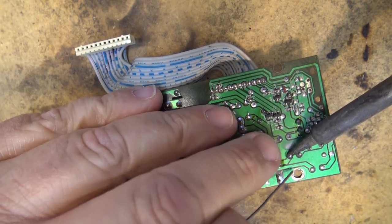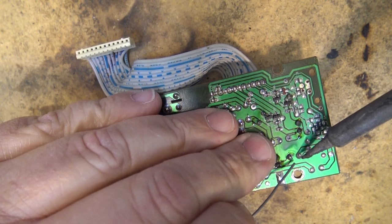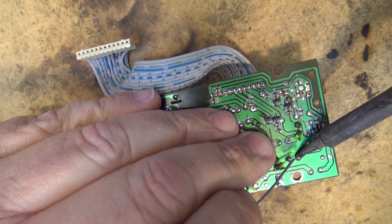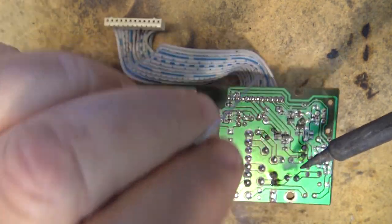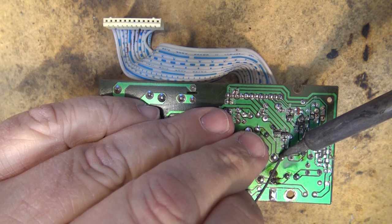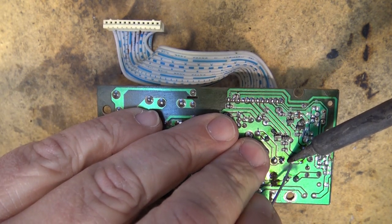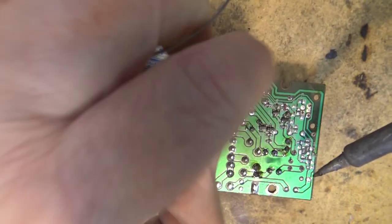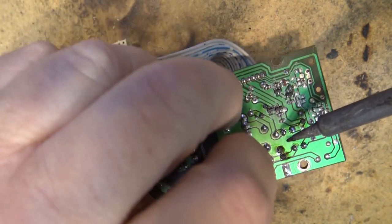on that inductor. These set-top boxes are pretty much a universal design. I think it's probably an FPGA type, the way it has to boot up and load the program when it loads. So it could be anything, not only this. The other inductor is over here. But it could also, for example, be a satellite receiver. It could do anything, because it's essentially software defined. And the power supplies on these, they are just off the shelf that the vendor just bought and plugged in. Do the diodes as well.